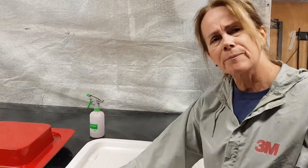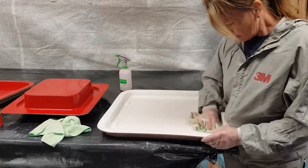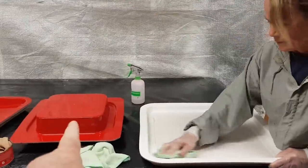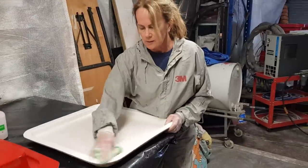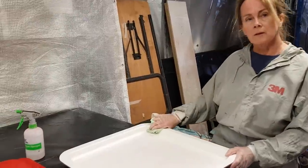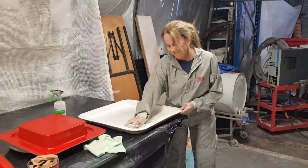So my plan is to make a product off this, cut it into four, expand it out to the size I need, make a new version of it, make a mold, and then reproduce the mold. That's going to take a lot of work but it's something I can do once I've got all the other stuff done. I was thinking as I've been polishing — as the molds are going — that we make an extra one of each so we've got a spare if there's any damage, and we can always pull a mold off that too. I like that idea because I can replicate it pretty quickly — it's like a half hour to an hour's work to knock out a product. We need four of those front hatch ones, so now we're going to make five — but actually six, because I need a fifth one plus a larger hatch for our windlass, which is going to be a monster hatch.